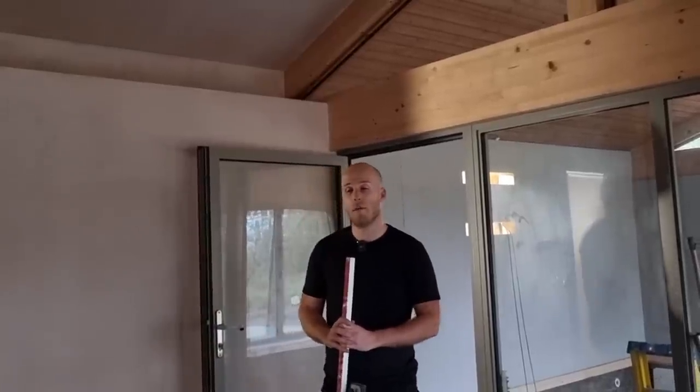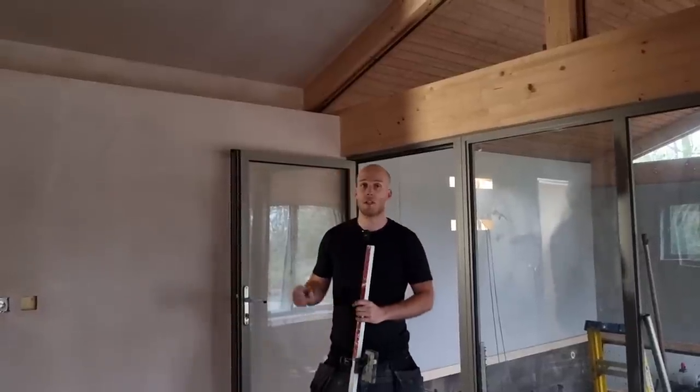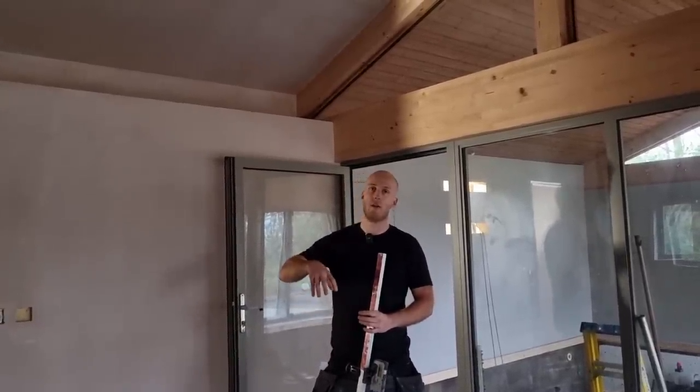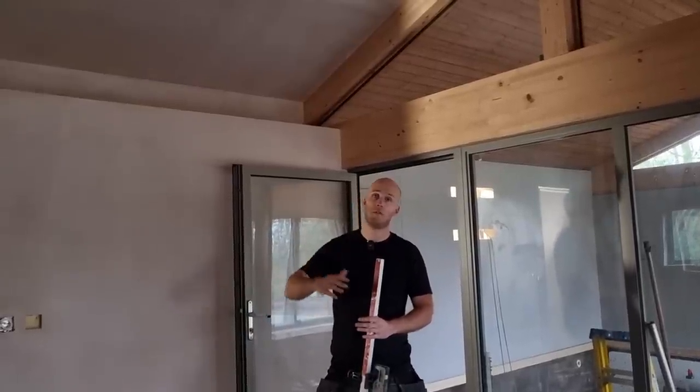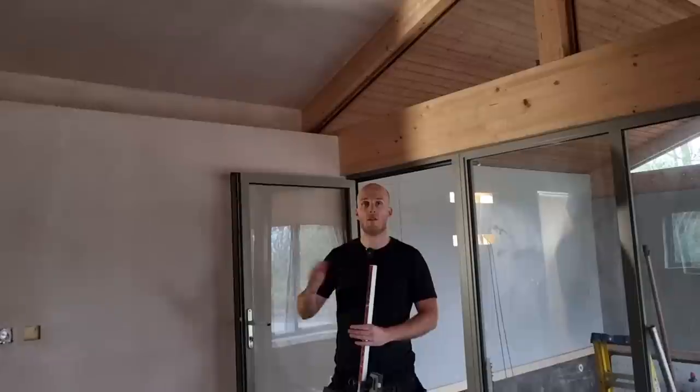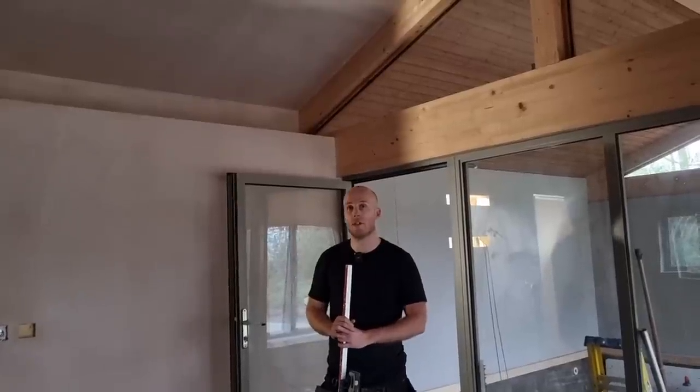In terms of curing, you can walk on it in 24 hours, work on it after 24 hours. But before floor coverings can go down, generally it's 14 days. So we would always recommend that any flooring contractor, if you're doing the flooring yourself, that you moisture test the screed itself to make sure that you're at a correct moisture level. Yeah, before putting expensive tiles down. What you don't want ultimately is any bond to fail because of the moisture content in the screed.